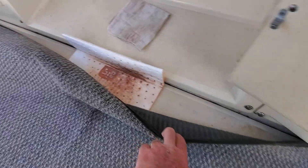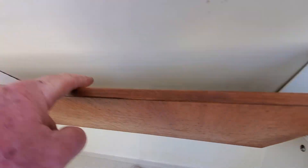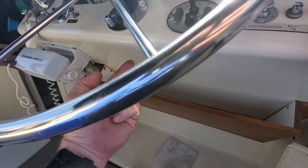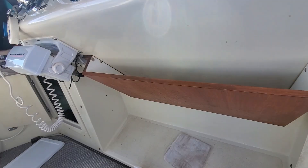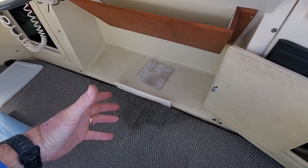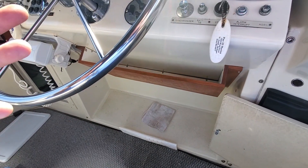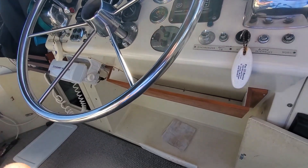Making a video about our oil leak. I noticed a stain in the carpet and then we noticed this little drip — it's been leaking hydraulic fluid from the hydraulic steering. We couldn't understand where it was coming from or why it was coming out when we weren't driving, because this system has a container below that is under pressure — you pressurize it to about 35-40 PSI — so it keeps the fluid pumped up to the helm.